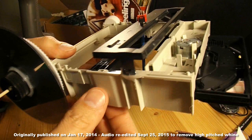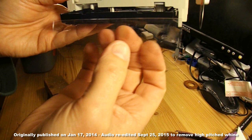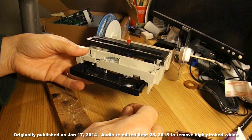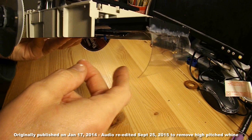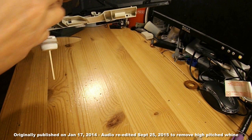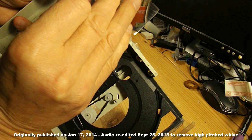Bracket in place, switch in place. That piece of plastic that I've cut from the pop bottle I'm going to glue on the front, because that's what gives it its forward motion. I've got our plastic strip in place along the front, bracket in place, switch in place, a couple of batteries. So I need to wire them up, and I've also got to put my bit of plastic that's going to rub against that toothed wheel and act as a ratchet, so I've got to hot glue that.